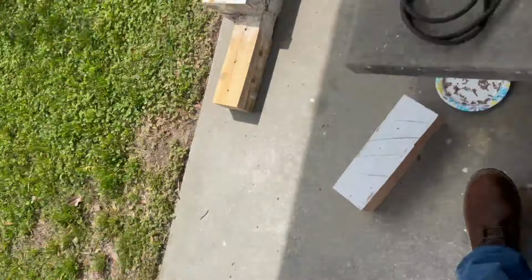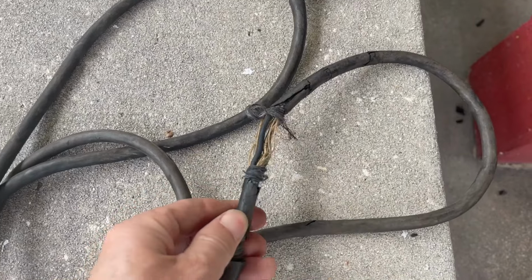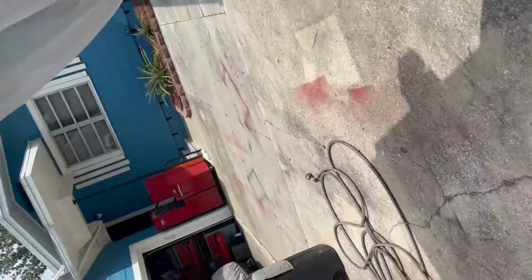I also thought about the missing spring, and even though the head was broken, I think possibly the head on that pin that holds the spring got broken when they were trying to force the switch in there before. And then they decided to leave the spring out in order to get the switch to fit in. So that was probably all done when it was rewired with this wonderful condition power cord, which really seems like a 1950s era cord. So what we've got to do now is we're going to take the front off and grease up the gearbox, and then we're going to clean it up. So that's going to be interesting.